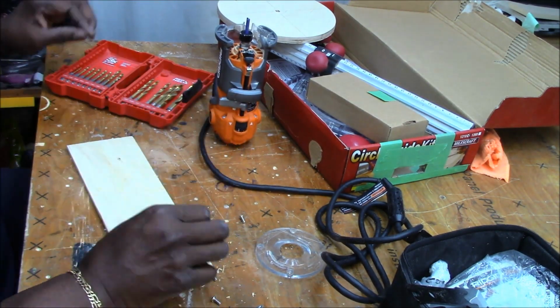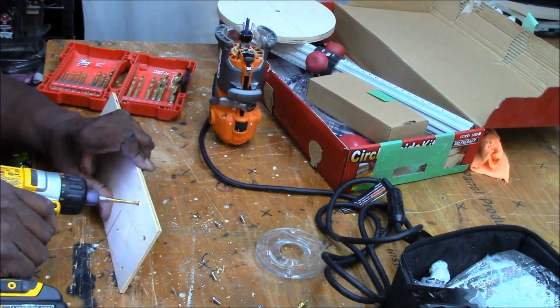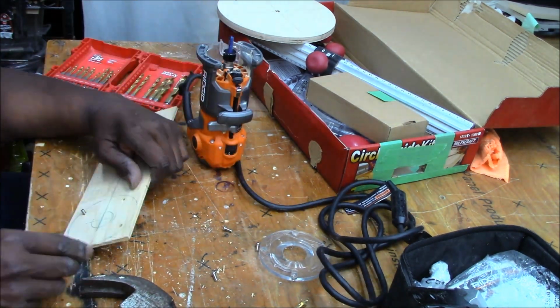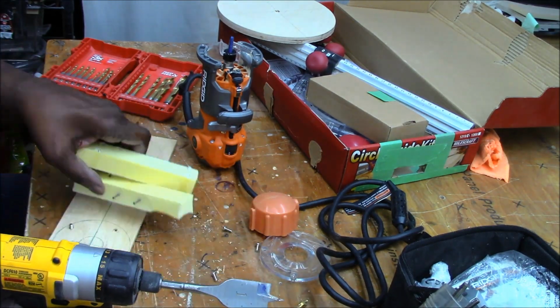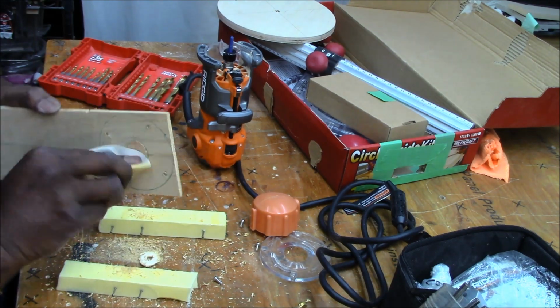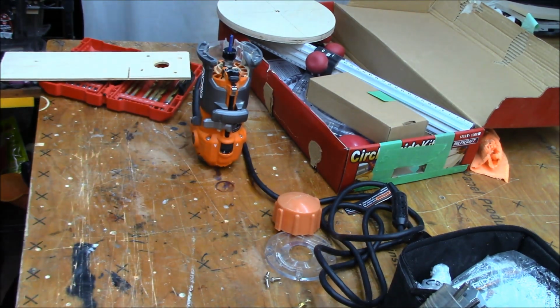compactness. The second feature of this is going to be lightweight construction using 1/2-inch thick plywood versus 3/4 inch plywood. Framing is going to be 1x3 dimensional lumber versus the heavier 2x4. This is going to provide ease for handling and transportation in a vehicle without excessive weight.